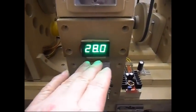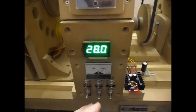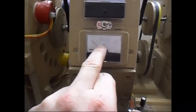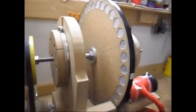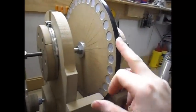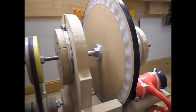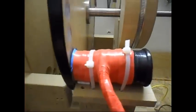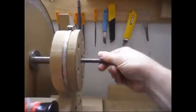It is saying here 28 volts, but when it's up to speed it will be around 29.5 volts DC, at around 1.2 amps on this meter here. Because of this larger rotor the diameter is larger, so the system does need more energy to spin it up. But the coil is performing pretty well at speed. Let me get it started up — give a little spin by hand, as always.